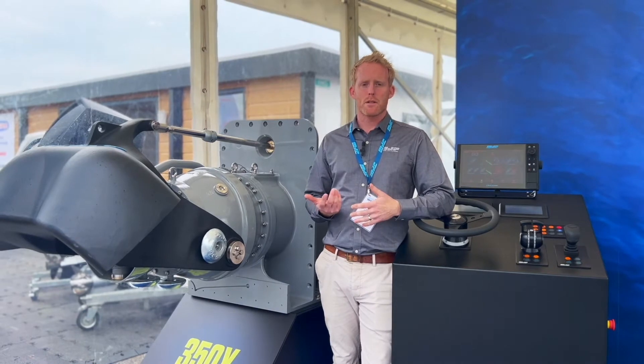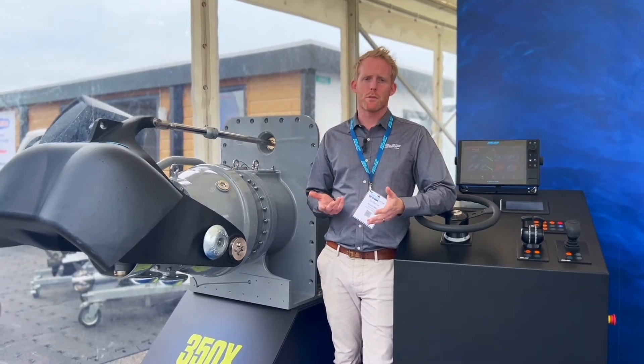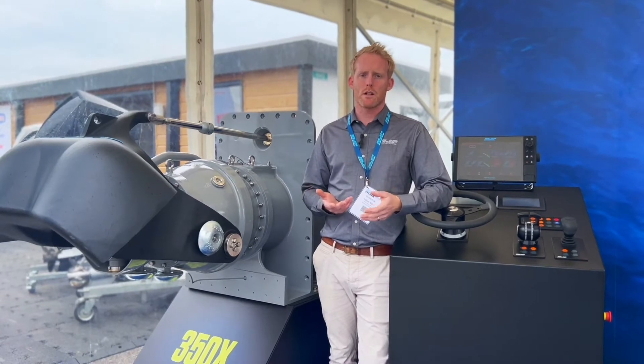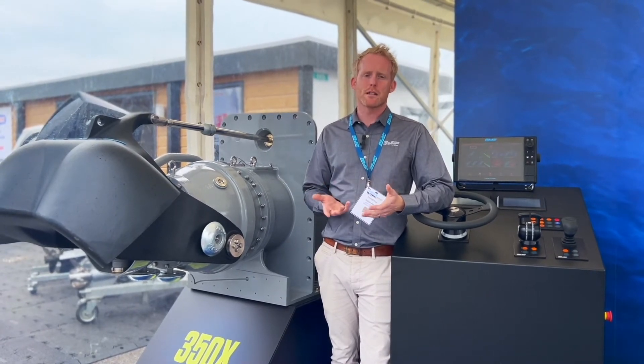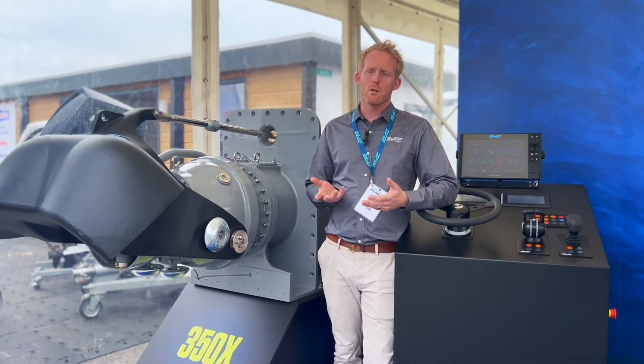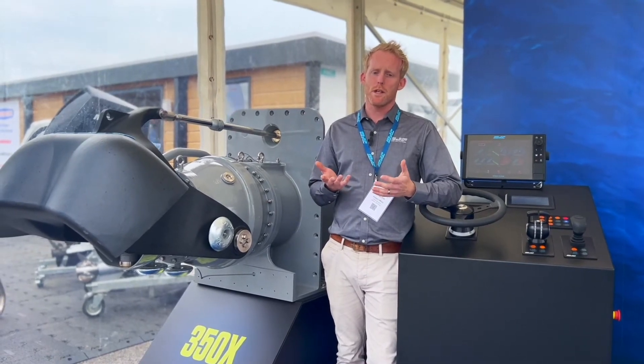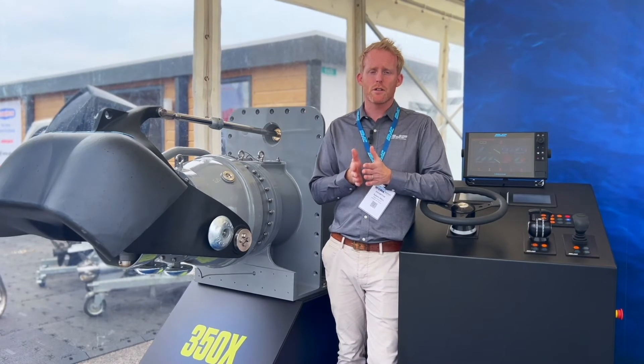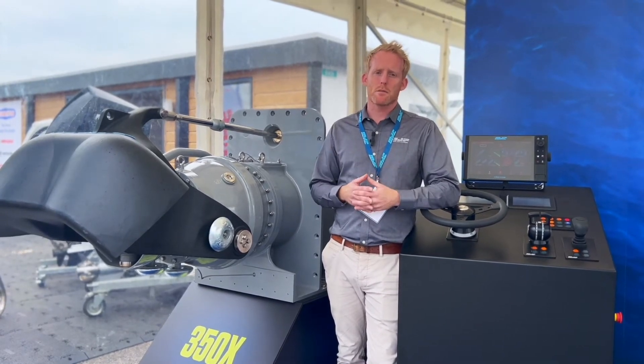Because our pump is all manufactured from duplex stainless and the impeller is as well, there is no requirement or need to have this isolating liner. That means we can close out the tip clearances to really very tight tolerances, which gives us maximum efficiency.